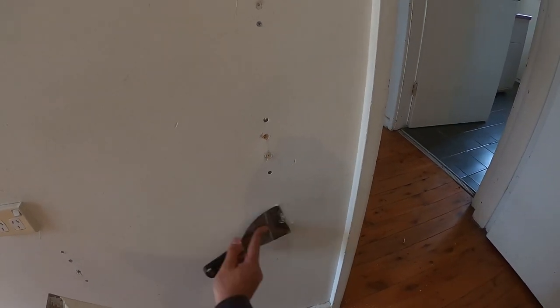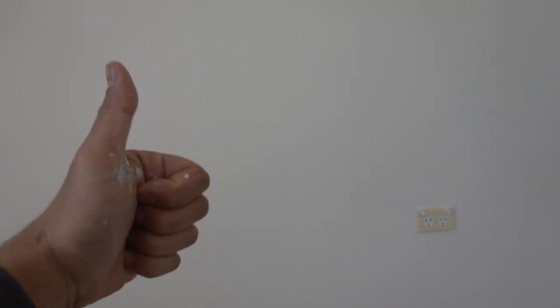Now everything's ready to be patched up. Use your joint compound and fill them all in. Once that's all done and nice and dry, take 120 grit sandpaper and lightly sand the area, followed by a second coat. Once the wall's completely painted, this is the finished product — we've completely gotten rid of those ugly nail pops, nowhere to be seen, nicely secured back to the wall to avoid it reoccurring. Hopefully you guys enjoyed the video and learned something new. As always, like, comment, and subscribe. Until next time, I'm Bill — thanks for watching.